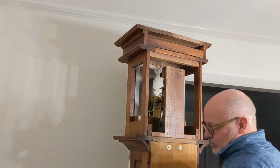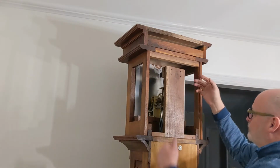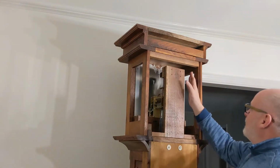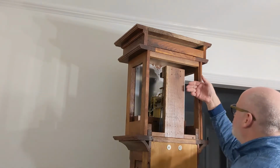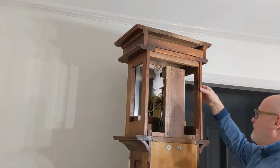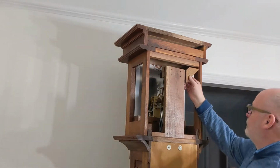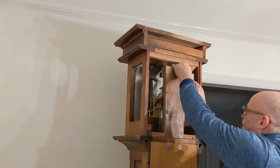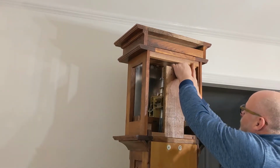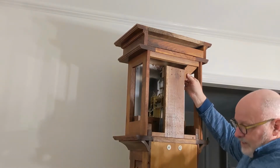can't shift around anymore. But it's a little difficult to get in there with, I'd like to be able to screw blocks of wood into it. I can screw in up here, I have room, but I don't have enough room to screw in on this side because of the panel here. So what I'm going to do is glue the wood here on this side and pin it with a nail. And then here I'll drill up and put in a screw, because I can do a screw